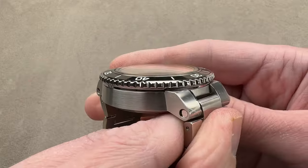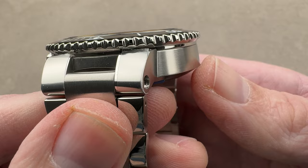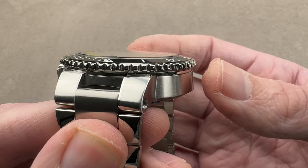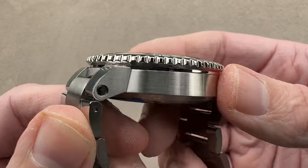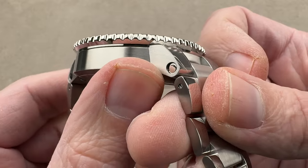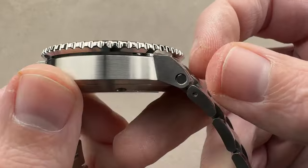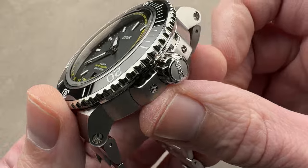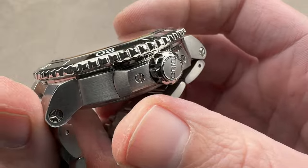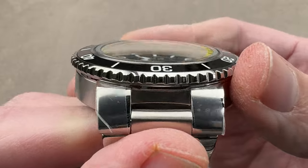That's important with a large and heavy watch like this. The case band is distinctive with a tumble home from the case back up to the top — a little conical slant, wider at its base than underneath the bezel. A combination of polished lug hoods and satin-finished mid-case, very much unlike the Seamasters and Submariners of the Omegas and Rolexes of the world, as these lugs are sharply broken out from the case band. We have a screw-down crown for this 500-meter water-resistant watch, with media blast and satin on the crown, and crown guards fixed by screws so they can be removed during service and replaced if gouged.